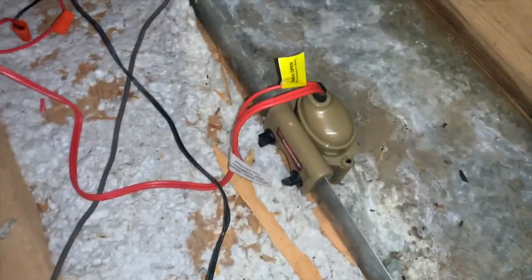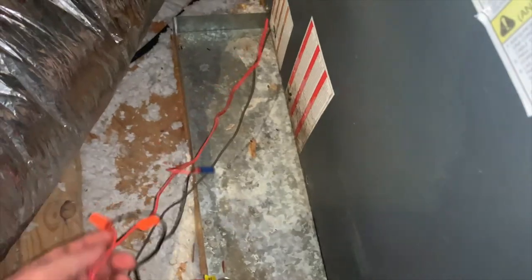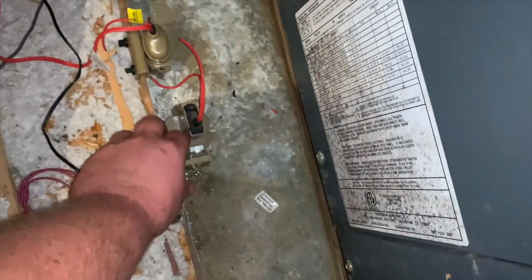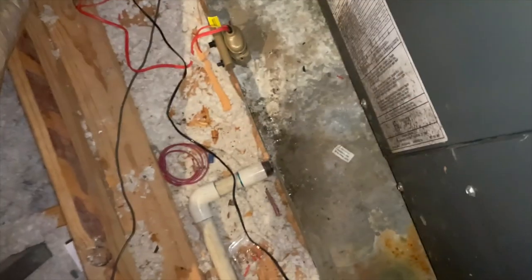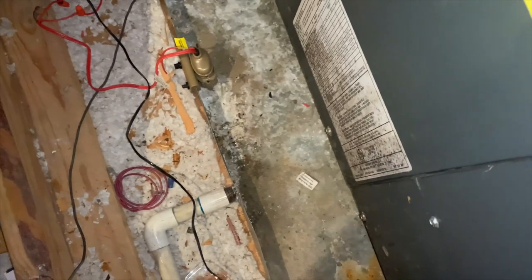New float switch tied in with the SS1 — they're tied in series, not parallel, so only one switch has to trip. This one was sitting in the pan and the other day I just barely touched it and the system came back online. It is Saturday, but I wanted to come back and do this before it failed again. They are back in business.